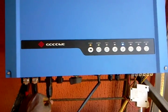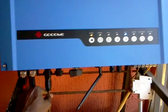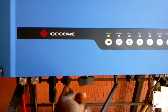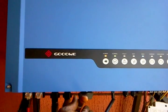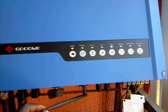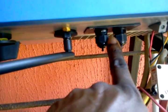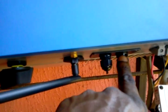The caveat is that these are at high voltage, so you need to be careful and make sure your installation is well insulated. Next to that I also have a spare set of PV connectors, because my solar inverter can actually support two strings with dual MPPT controllers that can control two strings of PVs. Next to that is my on/off switch, then next to that is my Wi-Fi antenna, which connects to the Wi-Fi module. Immediately after that I have two RS-485 ports for communication and network monitoring.